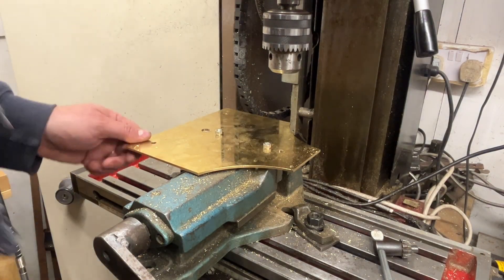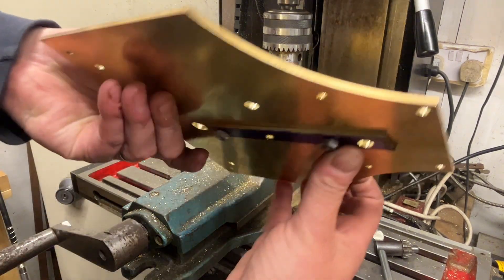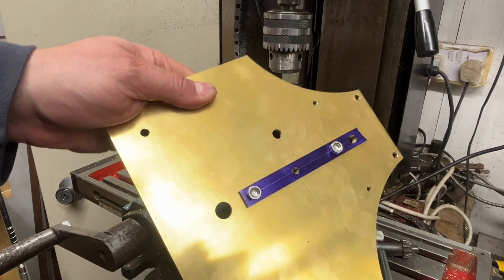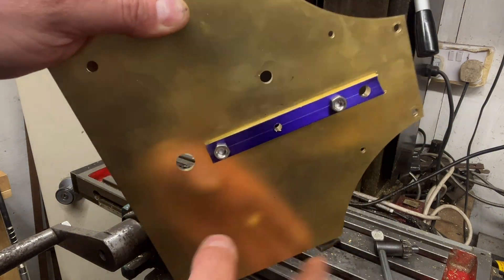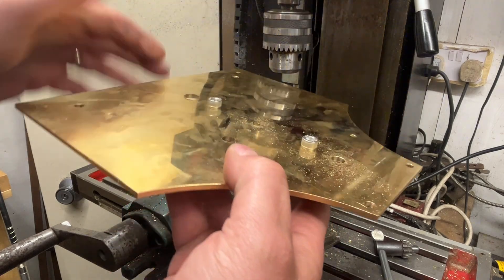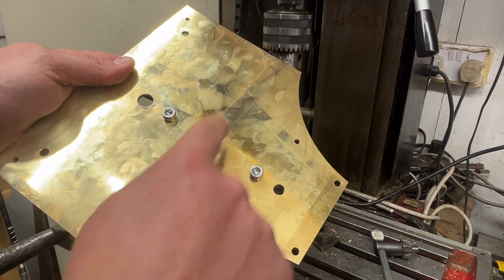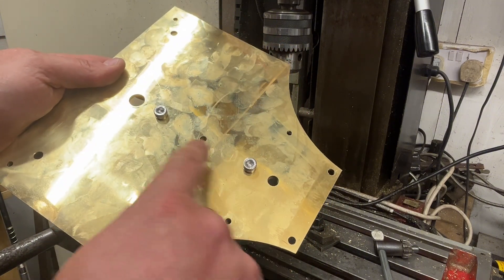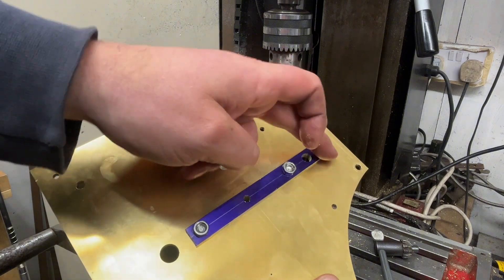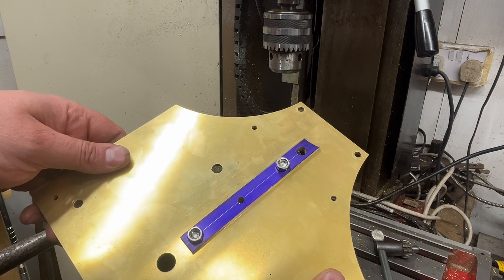This is how I've clamped the setup for the front plate — nice and simple. There's a strip just bolted onto the front, and I realized I could actually just clamp directly onto here so it's holding it nice and tight. Then just center and find the centers of the pre-drilled holes — this is obviously being taken from the depth-in — and then drill straight through. We'll release this now, tidy the radius up, make the pillars, and hopefully this should be ready to accept the bearings.